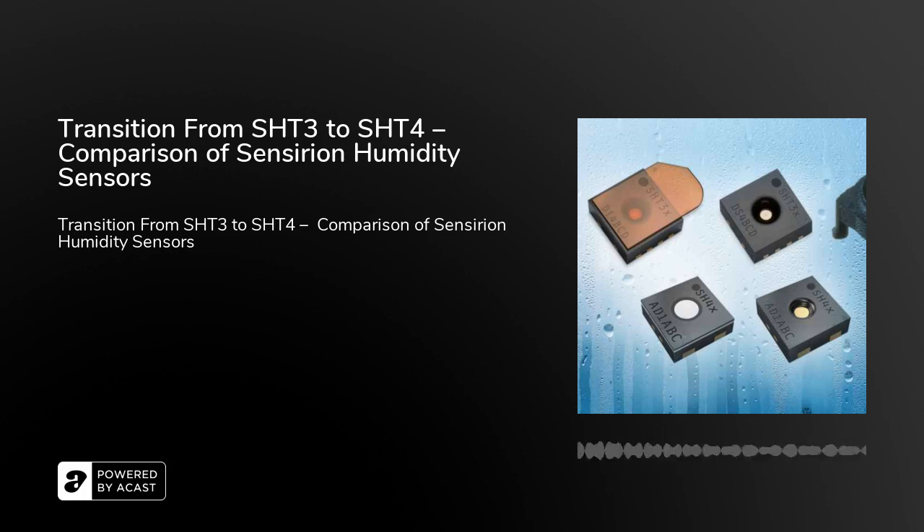Sensor Membrane Protection: The SHT3X series offers protection against water, dust and dirt with an SF2 filter or an integrated filter on the top surface of the sensor — available for SHT30, SHT31, and SHT35 DISF variants. If the membrane needs protection during production, a version with protective tape can be ordered (SHT30, SHT31 DISF). An SF2 filter can also be used to protect SHT4X sensors, and the series will be supplemented by F and P versions in the course of 2023.